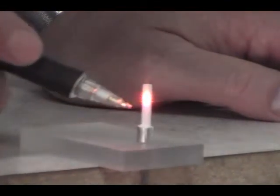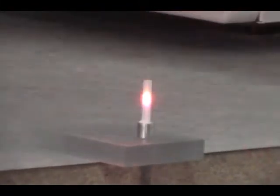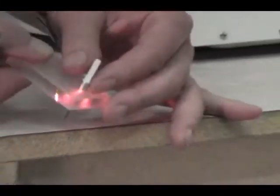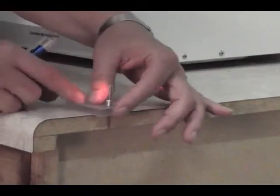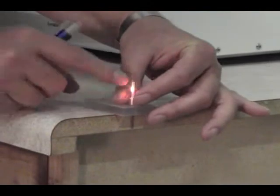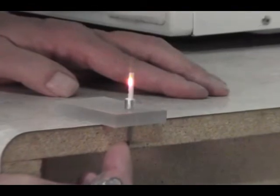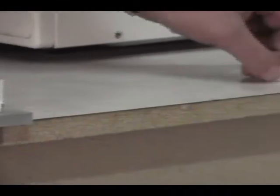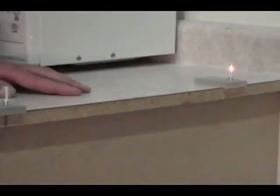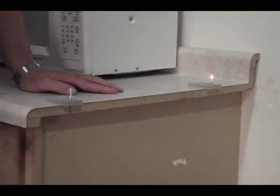Whenever we have a bad angle, for example in this case, we left the laser at about a 2-degree angle to this edge here. So what we do is we use this pin target. It has a very narrow, just the width of the beam, flat area with a pivot. So we set this up against the base countertop here and rotate it towards the laser. So when we hit this, it indicates exactly where the point is on the edge of the countertop. Then the next thing we will do is hit another one back here on this point, allowing us at any angle to hit a perfectly straight line without any measurement issues.